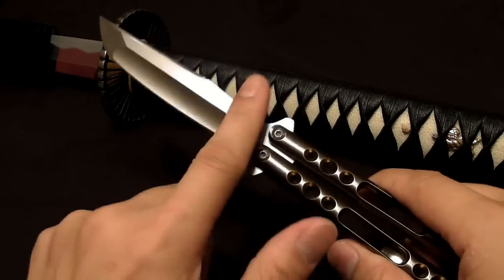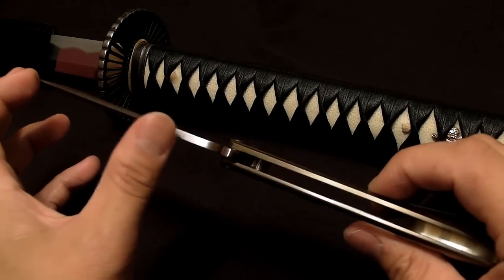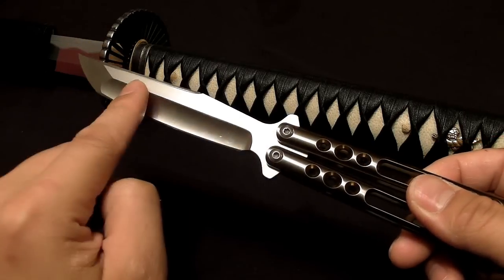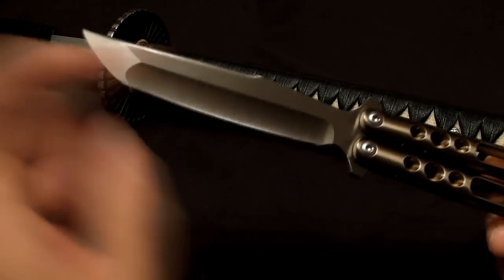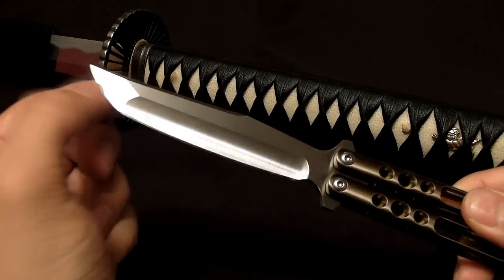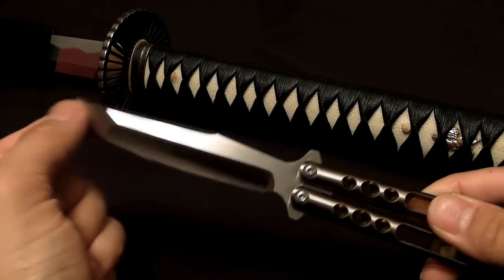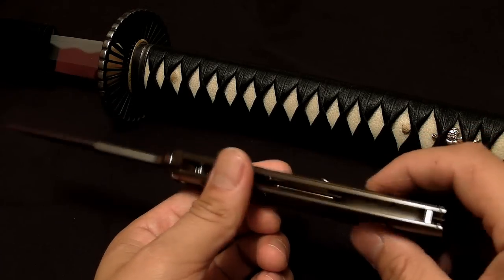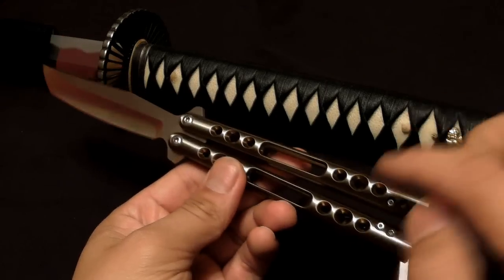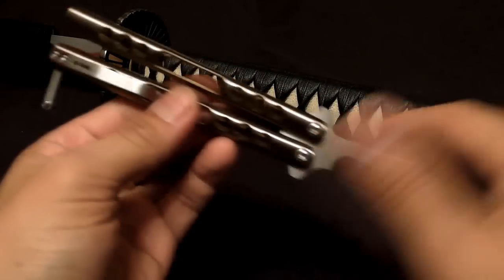It is still a little bit blade heavy, just because it's very long, and the stock is, although thinner, it carries, as you can see, there's a lot ground off here, but this is still the full thickness, and it's a little bit tip heavy as well, because this is not hollow. This is a convex grind here. So the blade still carries a decent amount of weight. I thought about a crazy idea of asking Sean to do these spacers in steel and seeing how that would handle it, but I don't really know if I would change anything right away on this.